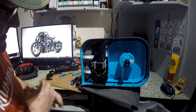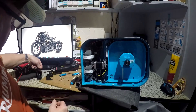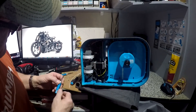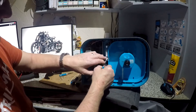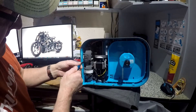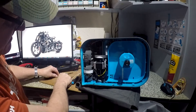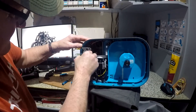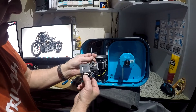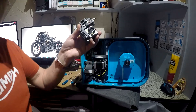Right, first thing you've got to do is pull this off - it just comes out of a slide, take that off. Then you've got to get this extruder out because it's blocked. First, pop the ribbon off from there; once you've popped the ribbon off I always tuck it behind there to stop it damaging. Then there's an Allen screw to take out here which actually holds your extruder in. Your extruder then pulls out, and you unscrew the PTFE tube to your nozzles. That is your extruder.